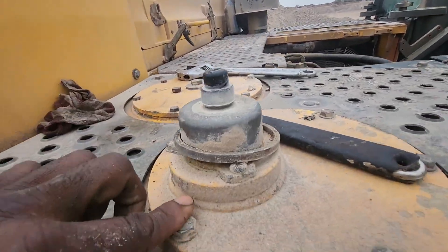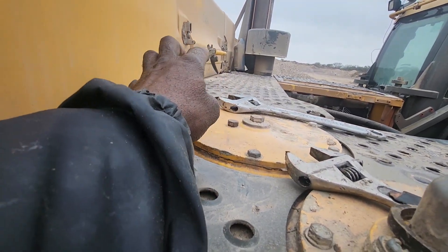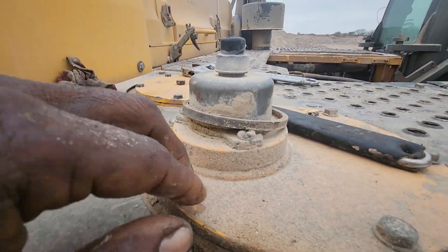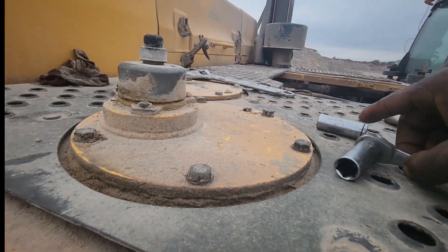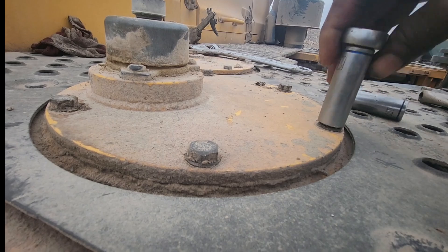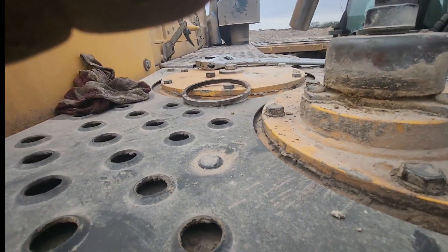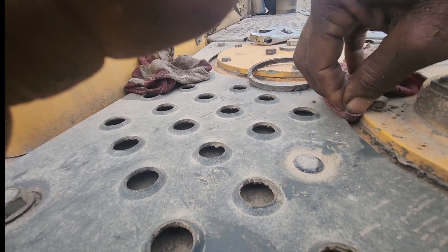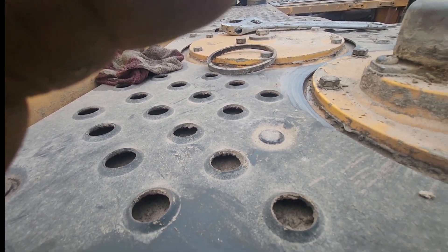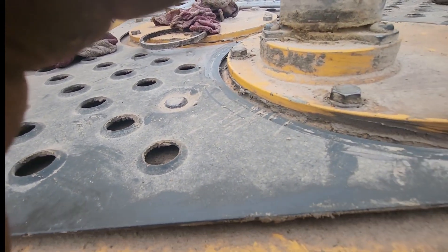To add the oil, you've got to take out these bolts here. Once the bolts are removed, you pull this cover off. Never touch that one — that's the filter. Take off these bolts on the outside, pick it up, move it to the side, then you add the hydraulic oil. These bolts are 16 millimeter, and they're already pretty loose. First, you want to clean the outside so no trash falls in there.